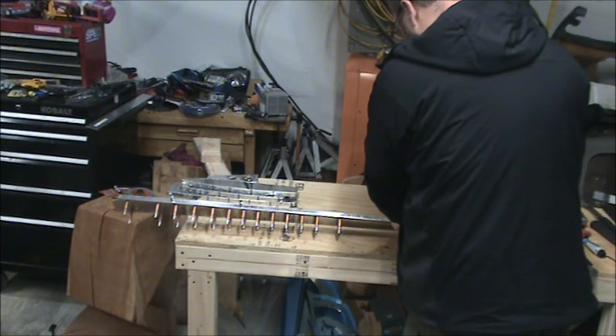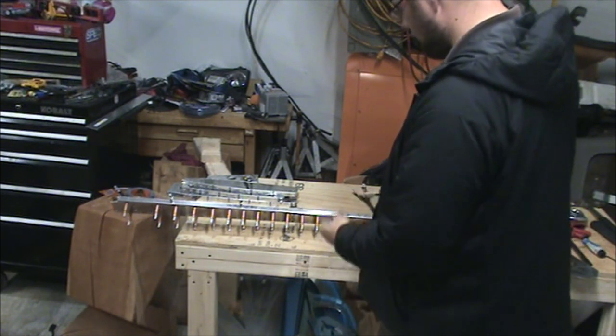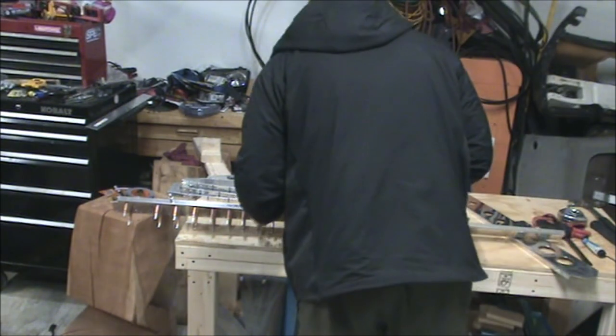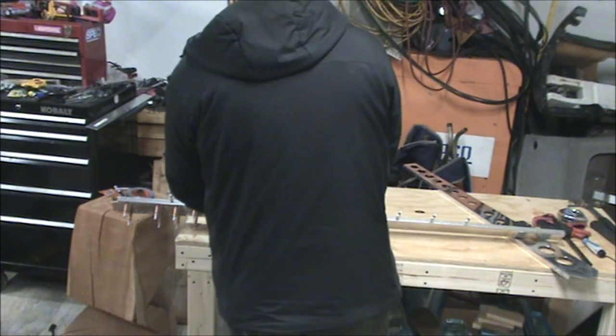And putting the cleco right here because that's the hole where the countersinking starts, and we don't want to countersink that hole, which is the bottom of the skin, the one that did not get dimpled. So that's kind of my indicator of where to start.